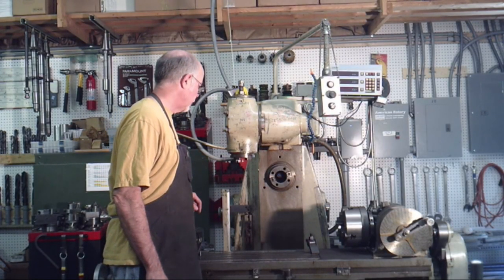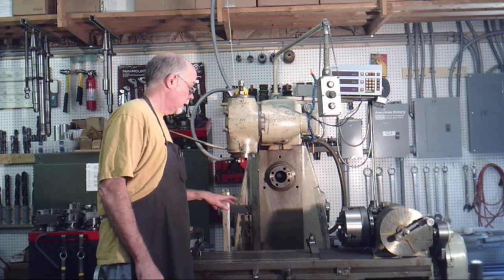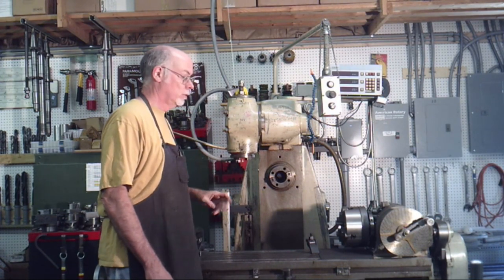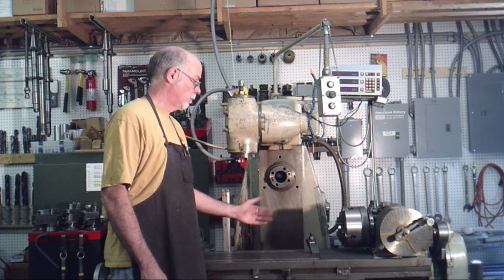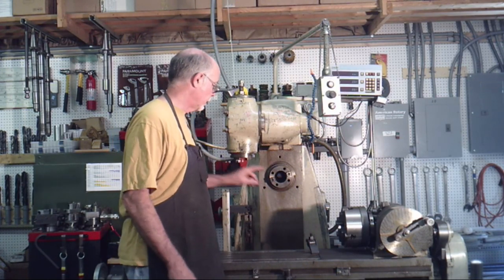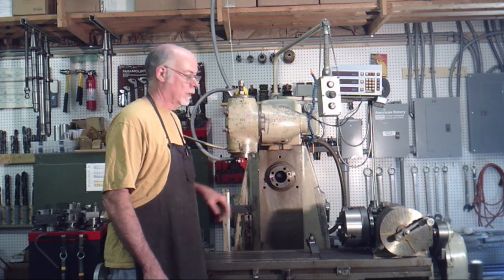This is Hydra, the three-headed monster. It's a Cincinnati Cinova 80-205-12 milling machine with an independent overarm spindle on it. So I've got horizontal milling capability and vertical milling capability. It is a universal mill, so the table pivots, and it has a lead attachment with a dividing head on it. This is the reason I call it the three-headed monster. One, two, three. And what we're concerned about right now is the horizontal spindle.